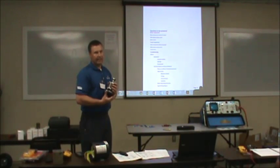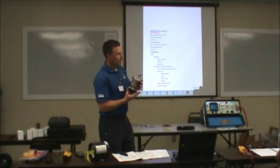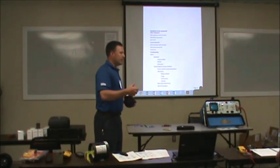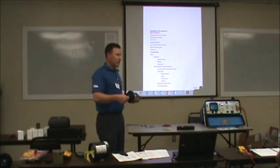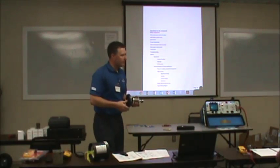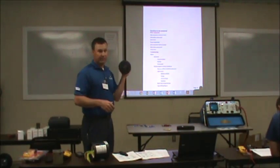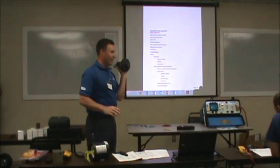In the 16 years I've been in business, I've seen 3 or 4 motors with broken rotor bars. But it does happen, and you would think there's nothing wrong with the motor. The motor will run fine, not under load. Run it idle and it'll run fine. The way to find them is to apply low voltage to it, assembled, and begin rotating the rotor. As the rotor bar passes through each pole, you see an amp spike, so you know you've got a bad rotor bar. You can do growler tests and different things like that. But as far as mechanically, a motor has pretty much just bearings. As far as what you're driving, that's a whole other ballgame. It can get complex.